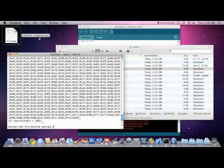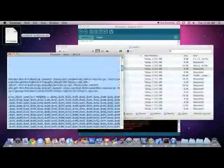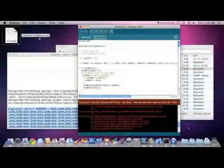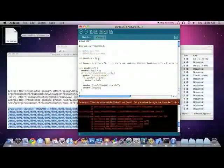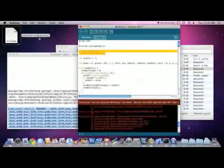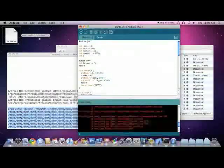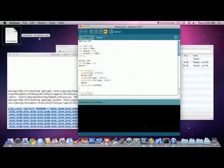And what it does, it generates the same hexadecimal code, but something that can be inserted straight into an Arduino sketch. So select that, and then we paste it into this Copier tab here, which is all of the copying code, an implementation of the STK500 protocol that the Arduino uses to upload sketches. So just paste that in there, and set that there so that it will now compile a version that is capable of copying the original over to another Arduino, and set serial port and upload.